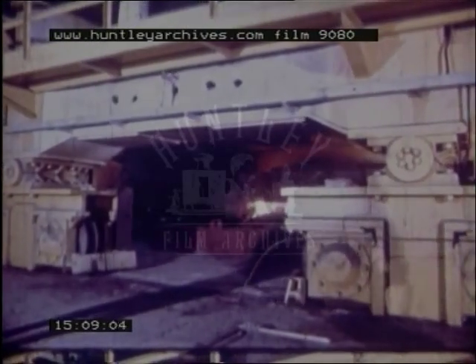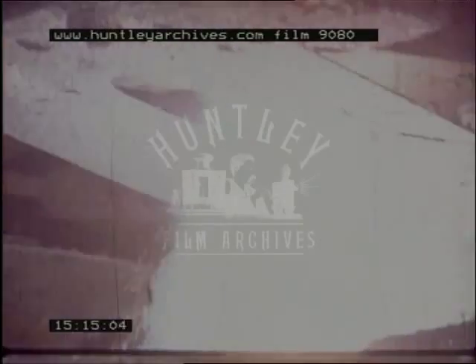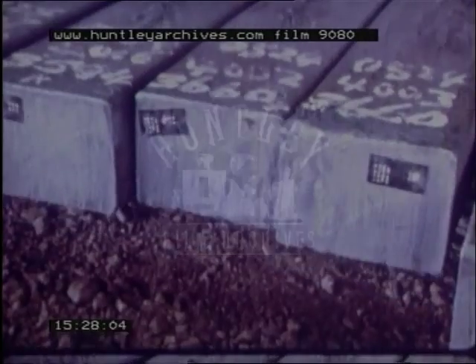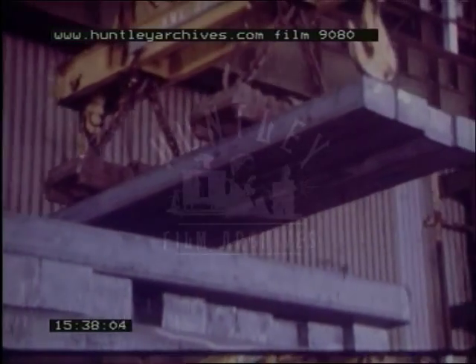Sequence casting enables a very high production rate to be achieved, which makes the process ideally suited for bulk orders. In addition, there's very little waste with continuous casting, so yields are higher. The products have good surface quality and regular cross-section, and there's economy of plant. It's techniques like continuous casting that point the way to the highly organised and highly productive steel manufacturing techniques of the future.